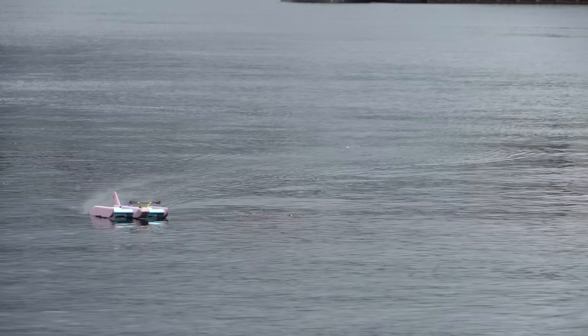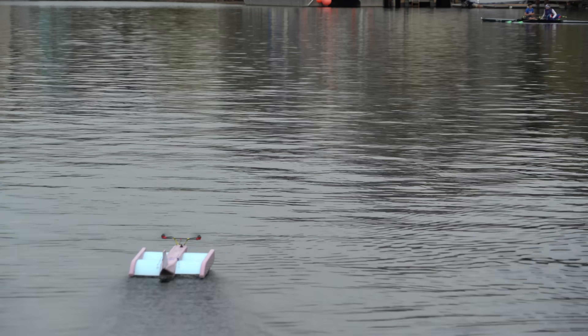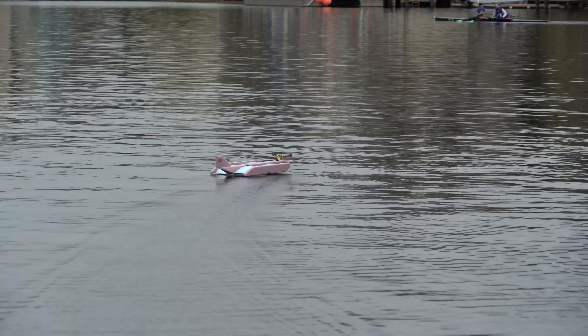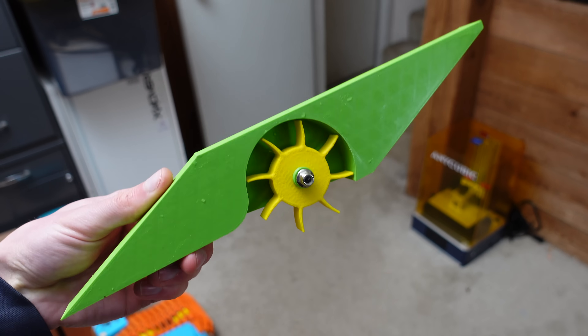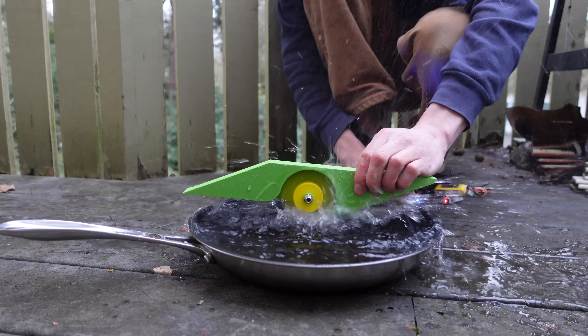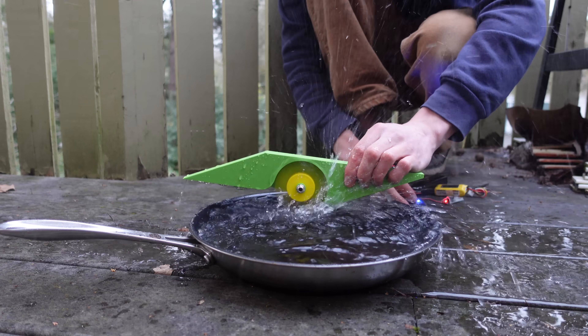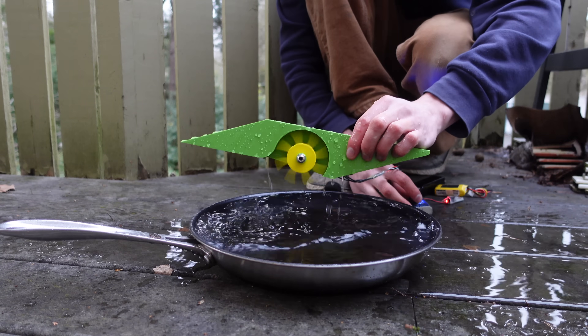I actually first had this idea way back when I built a tandem-wing par-thrust ground-effect hovercraft kind of thing that never really ended up working very well. The first thing I did was design a paddle-wheel pontoon to experiment with. What that taught me was that this type of design would just act like an impeller, sucking air in through the sides and blowing it out through the outer diameter. This air would blow the water out of the way and prevent the wheel from really ever digging into the water.